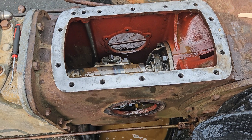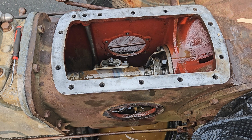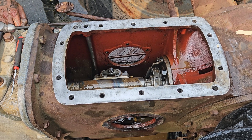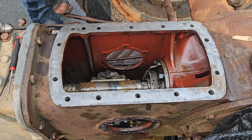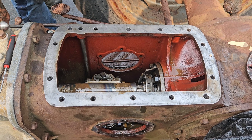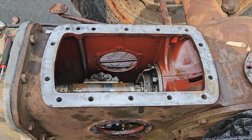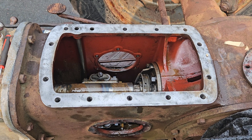Silicone is not impervious to oil, and what's on the oily side breaks off. I've seen this in pro late model cars with silicone stuck in the rear ends — stock cars with oil pumps in the differential, all full of silicone. You've got to use this stuff sparingly. A little dab will do you when it comes to silicone.